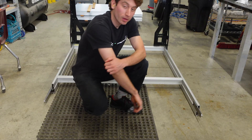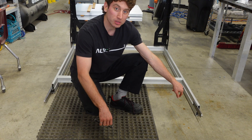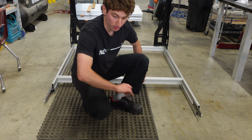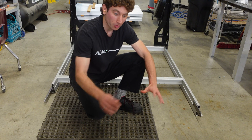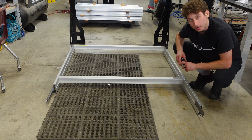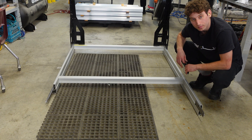Starting to put it together. What I'm going to do right now is make another one of these plates, do some more machining on these Y rails to add holes for — A, the plates and B, legs to mount — so that four legs on each half. It's going to be a heck of a lot easier to assemble this whole machine if both halves are standing up with four legs. But it's fun to talk to the camera, so I'm going to start machining.